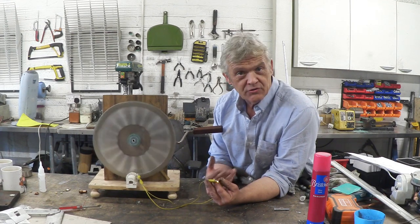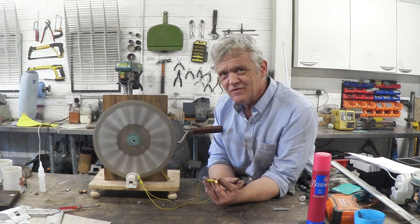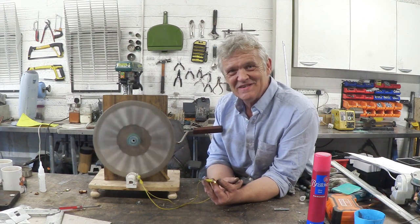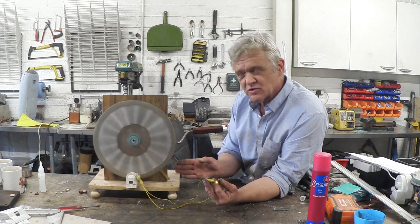This video is a bit of a template: there's been an introduction, a how-to, some construction details, a close-up, and then a demonstration of the thing actually working. Remember it's a proof of concept. For the competition, we'll collect all videos up to the 31st of October — the closing date — and then all the runner-up videos will be posted at the same time so nobody gets an advantage for posting early. This clockwork generator generates between 9 and 12 volts — 12 volts when the magnet is close to the coil and 9 volts when it's further away, due to the wobble on the wheel. I hope you enjoyed the video — please like, subscribe, and enter the competition.